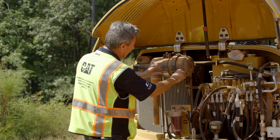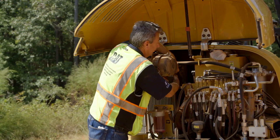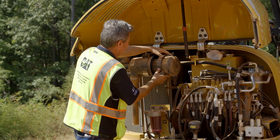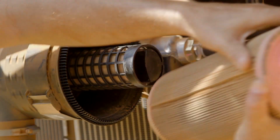Now if you're going to go in and look at the air filter, it's got three clips around the outside and inside will be two filters. You've got a primary which is the outer and then you've got a secondary which is the inner. We'll pull out the outer to start off with — you can see there is quite a bit of dust on this as we pull it out.